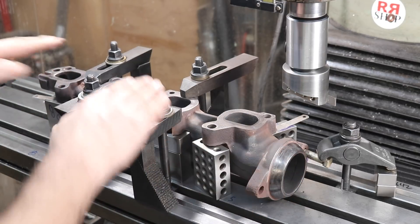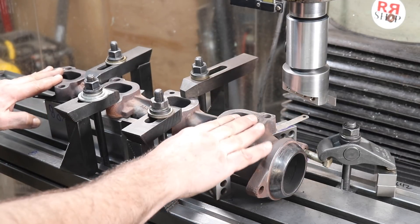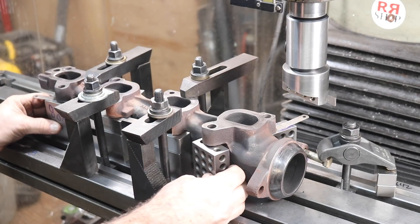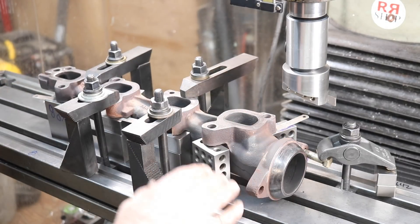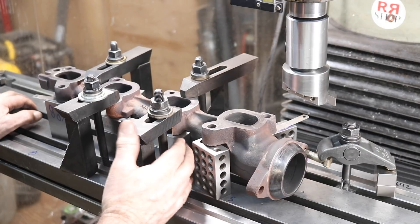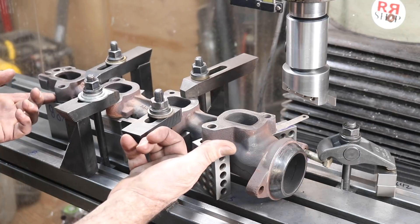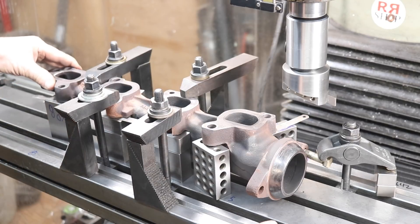I'll mill the ends first and then come in and mill the centers. We'll clean up the lowest end first — that gives us our zero point — then bring the other end down to match, move the clamps, and do the centers. The manifold is supported on blocks and shimmed to be relatively parallel to the table. I'm using 1-2-3 blocks, my Fireball squares, Fireball tool setup blocks, and various small shims to account for the differences, since these castings aren't all machined the same — typical casting from a typical auto manufacturer.